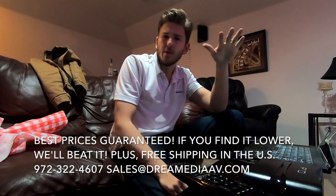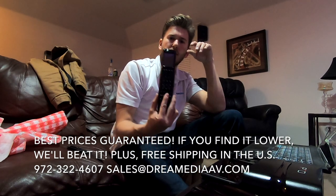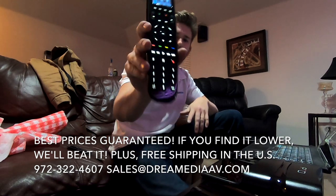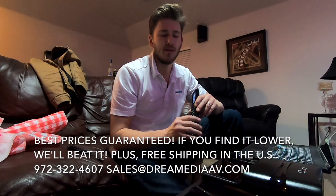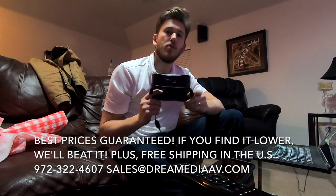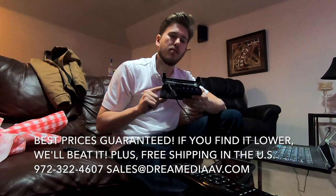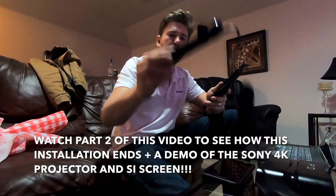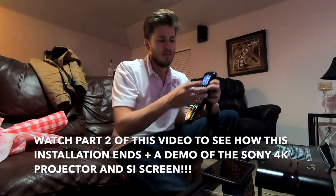I'm programming in a universal remote for this customer. The system I'm using — you've seen me use it a ton, I've been using it for years, it's super reliable and looks clean — it's the ProControl Pro 24.1, a button-press touchscreen remote. Super sleek, very reliable, and fully customizable. I can literally create every single macro myself. It communicates over radio frequency back to the closet so you don't have to point the remote — it can be buried in the couch and still work perfect every time. The remote talks to the hub and then it sends the signal out infrared to the devices. There's also a nice dock to charge it — no batteries to worry about, you just slip it right on the dock.